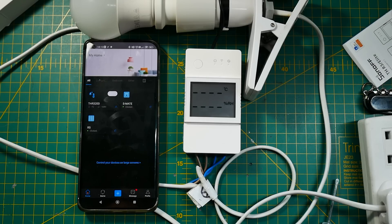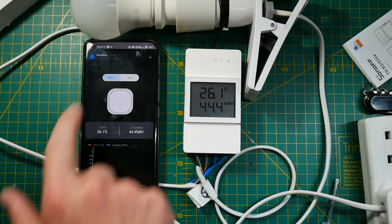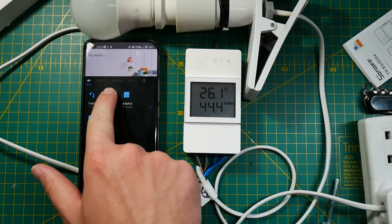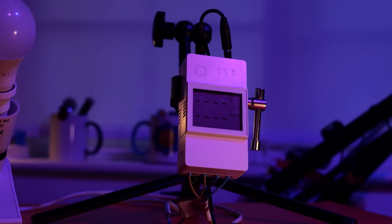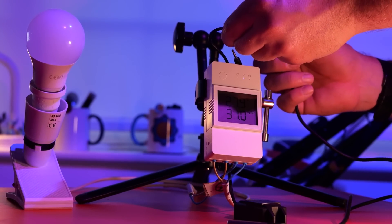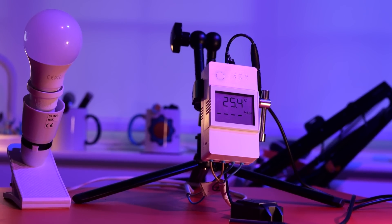Unfortunately, that doesn't work with humidity, so even if you have a probe with humidity readouts, you're out of luck. I hooked it up to my test setup to see it in action. After the initial setup, I discovered that for a minute or two I had some connectivity problems and couldn't toggle the relay, but that settled down and after that initial period I had no problems. There wasn't any firmware update waiting — it's just some little quirk. The device updates the screen every five seconds so you get fresh information from your probe. In my experience, I think I got sent a dodgy probe because it wasn't submitting information constantly — it would drop out and skip the beat, not submitting temperature and humidity information. I confirmed it was a probe issue and not the TH issue by connecting a second probe, which submitted temperature information without any problems.